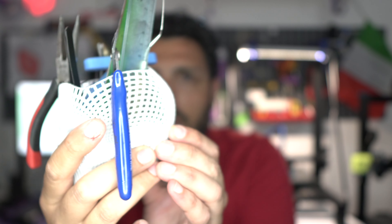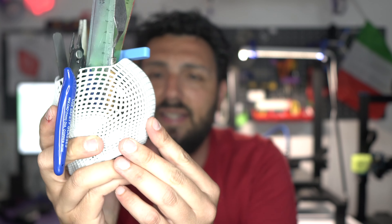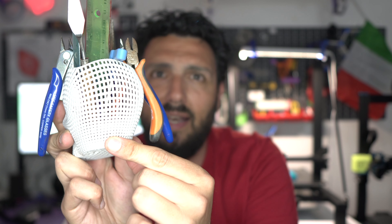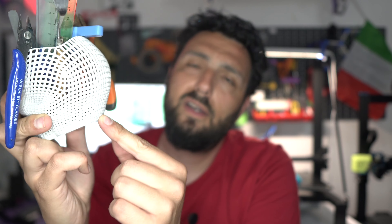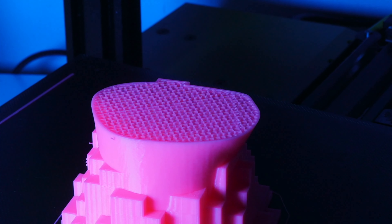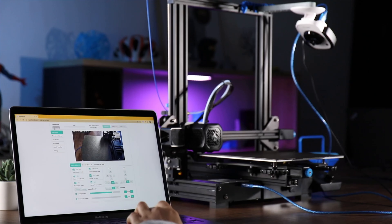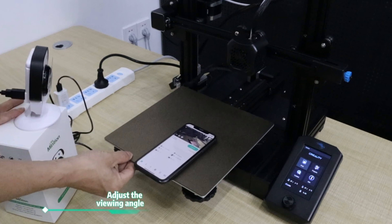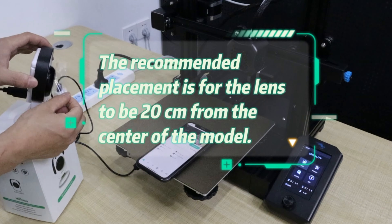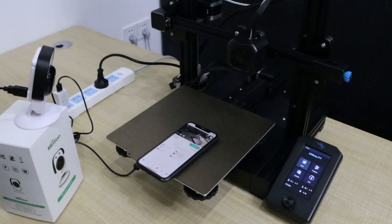Let me see if I can focus this. This print came out amazingly, and the point where the printer was leaving the layer to go and take the picture is right here. But as you can see, there's no retraction debris or any pieces of filament left running, as was happening with Octoprint. Resolution is 1080p, and the camera comes with a set focus of 20 centimeters to the object — so if you're not exactly at 20 centimeters, you will have some out-of-focus results.